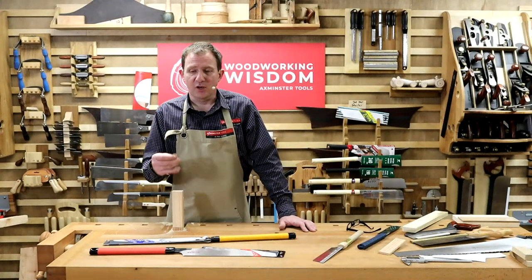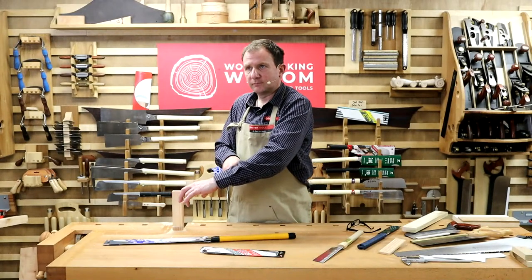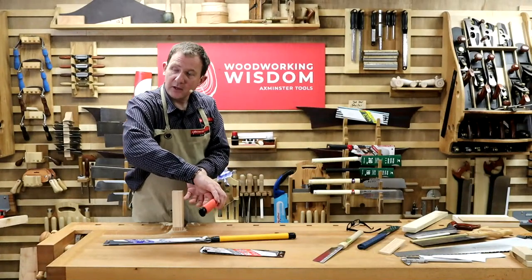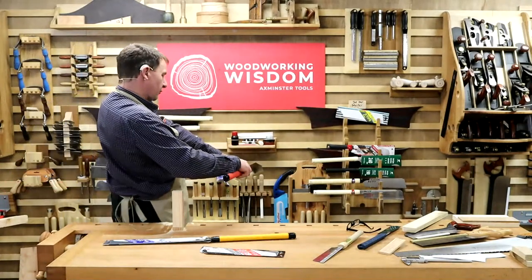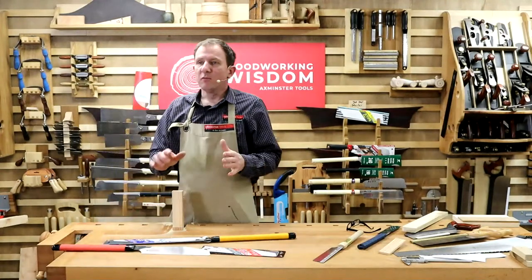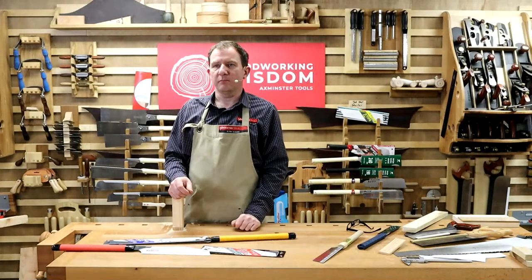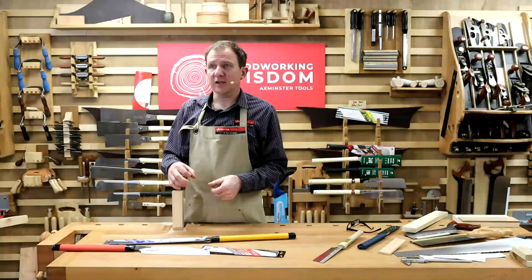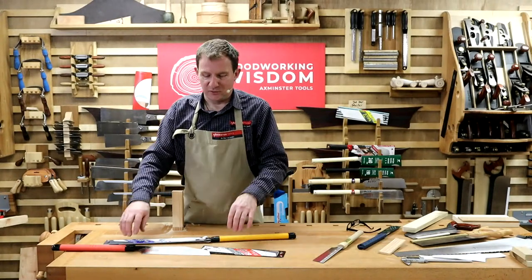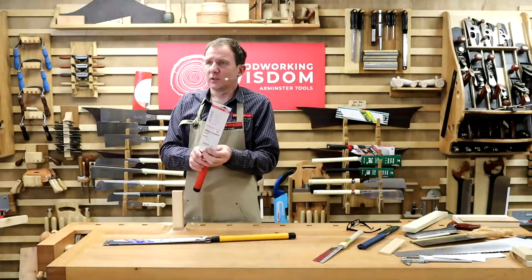Other thing with this, if you're going to do that sort of scenario, I tend to reach over. Okay, so I grab the work. If you have access, go to the other side of the lathe, and then you'll be able to hold the workpiece and pull the saw towards you, but you need to stand the other side of the lathe to do it. Remove your tool rest so you don't clip the saw blade against the tool rest and damage the saw, because the tool rest is softer metal, that's harder, you'll chip the edge of the tool. Don't go having your lathe running, all right? Not a good idea. Okay. Ben, you got another one?